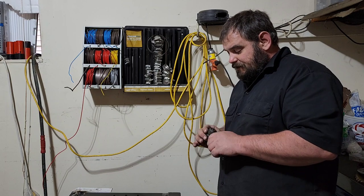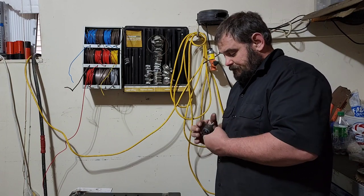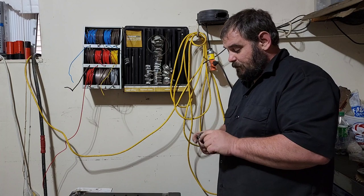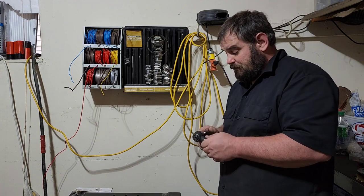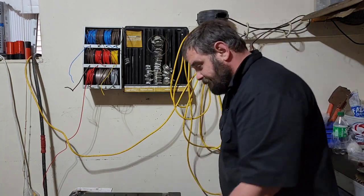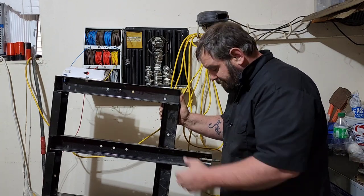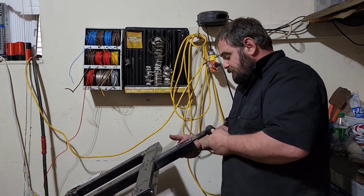Okay, so now what I've decided to use for my central pivot point is a tie rod end. The main reason is because it can move in all directions smoothly. It's got a grease point so you can service it, and the odds of this thing wearing out, when it's designed to be on a car turning all of its life, is very minimal. How I'm going to do that is I found a bolt that fits it thread-wise, cut off the head, and welded the bolt to the bottom side of the frame so it's nice and sturdy on that end. And then what I'm going to do is screw this onto it,